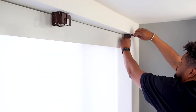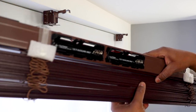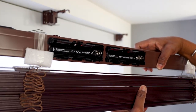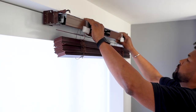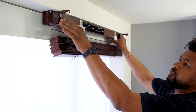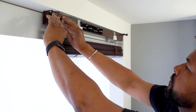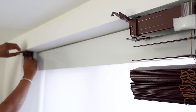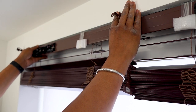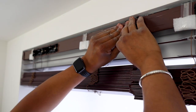Now that I've got my brackets in place, let's install the wood blinds. I prepare the brackets by opening the doors on each of them. The key is to pull the blind away from the headrail in order to separate the top slot from the headrail so it's clear of the mounting bracket. Then slide the blind in by inserting the headrail into the mounting brackets. Close each bracket door, pressing it firmly to ensure that the tab at the bottom of the bracket engages through the slot in the bracket door. Do exactly the same for the blind on the left, making sure the bracket doors click firmly shut.